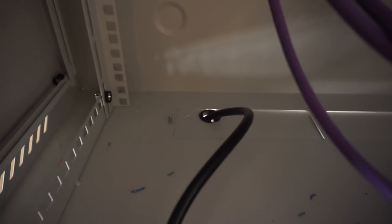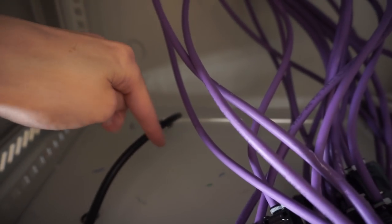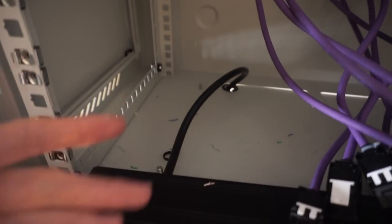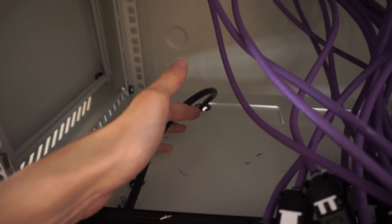So what I'm going to do is, even though it goes to this grommet at the back, the grommet is split, so I can actually get the cable out of this grommet. It wasn't fed through there and then wired in, so that's easy enough to do. So what I've got is some inline 16 amp connectors. So what I'm going to do is cut this flex and wire that on. So essentially I'll have a connector in the middle here that I can easily unplug to separate the two, or I can put them back in and connect the two. So that'll do. It just means I don't need to take the PDU apart to remove the flex, and it means in the future it's easy enough to remove.